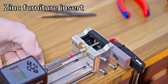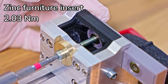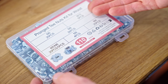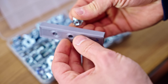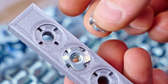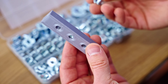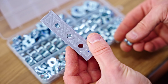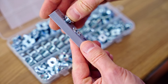Even though these inserts are quite brittle, because they engage more of the printed part, they still manage to match the performance of the heat set inserts at around 2 Nm. Next are pronged T-nuts — what's special about these is that they actually go in from behind, which can cause quite a bit of damage. Because these have that large flange in the back that we're going to have to pull all the way through our printed part to get something to fail, I don't think it's going to be the metal insert that fails — I think we're just going to crack our printed part in half. But thankfully our test fixture is reinforced, so that shouldn't be a problem for our setup.